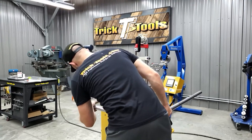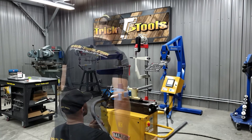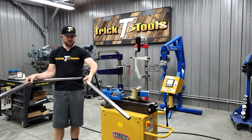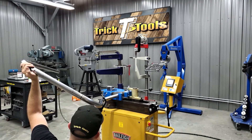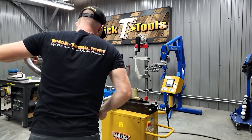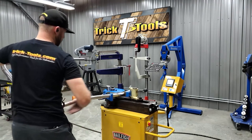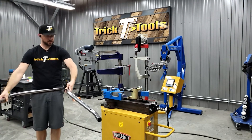We meet that zero mark again, so we want 180 — now we're going to go down, sliding this down even further. There's our nice 42-degree bend right there. You can see the profile now — that bend is going out and down away from the center line of what is going to be the center line of the frame. And now we are at 180.